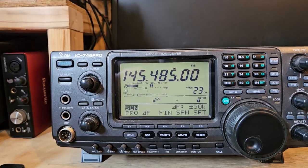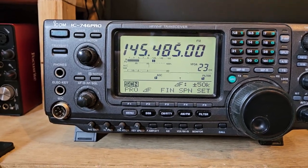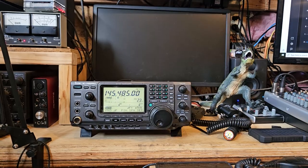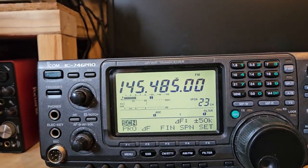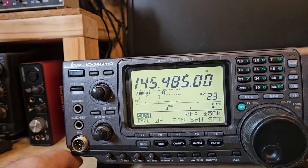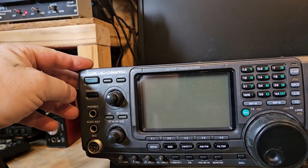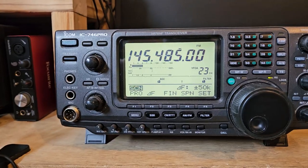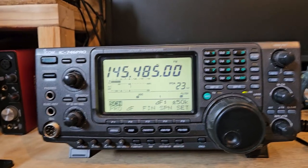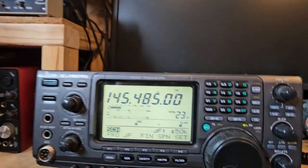Unlike the 756 Pro series, the display on this one is LCD and sometimes takes a second to power on. It's got a certain tint to it. I think it's using a CFL — compact fluorescent — bulb for the backlight. The radio itself is set up a lot like the 756 Pro, but it doesn't sound as good on transmit — it's not even close, and I really couldn't tell you why. The main thing I use this radio for is two meters because it doesn't really sound good on HF. Also, early models have a very bad reputation for burning out the IC151.